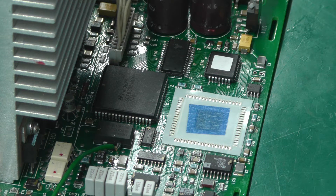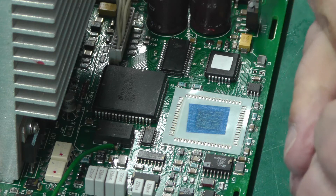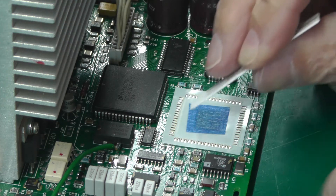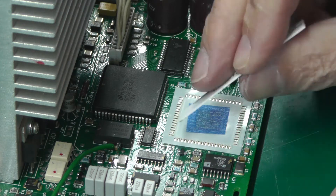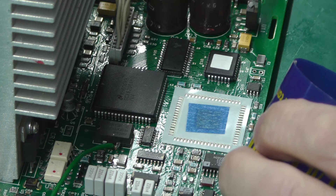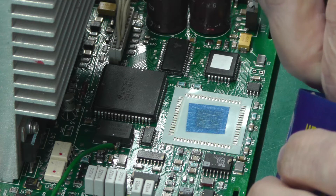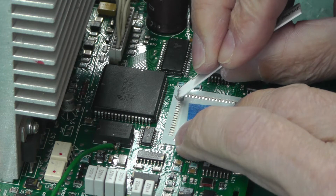I'm going to use a little bit of plastic to apply the paste. I'm not going to be able to wipe a whole load of paste down in one go like I normally do — I'll have to dab it on a bit at a time where I can get access. The problem might be that the paste goes down through the holes and underneath. I'm using leaded paste for the lower temperature, as I don't want to use my normal GC10 from production runs since it's too high a temperature, and I'm not sure what temperature these sockets can accept.